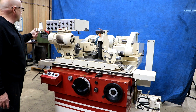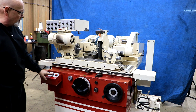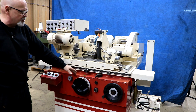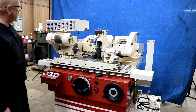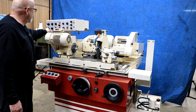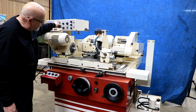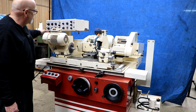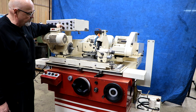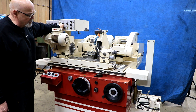When we're ready to go into grinding, we put it in automatic. We've got our wheel on. We press the cycle start button and we come in. Our table starts to move, our work head comes on. The work head is controlled by the speed here. The table speed is controlled with this knob up here. Each time we reverse, we feed — I can slow this down or speed it up.